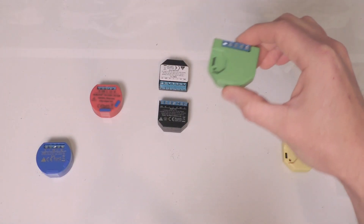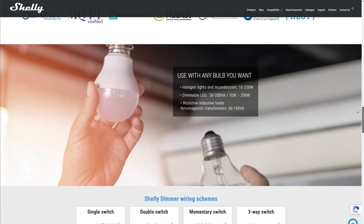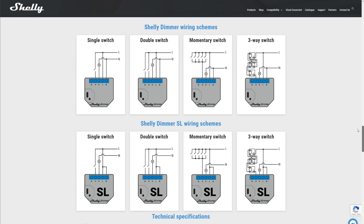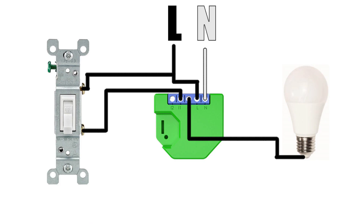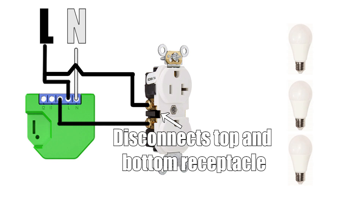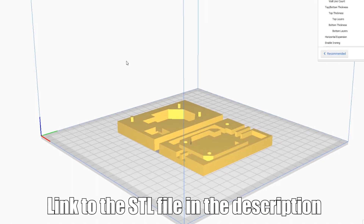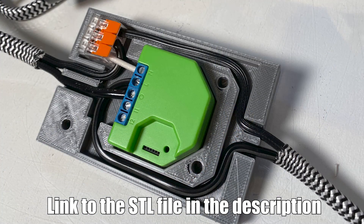The last and newest device in the Shelly lineup is the Shelly Dimmer, a triac-based dimmer that connects to mains power and can dim up to 200 watts of dimmable LEDs or halogen bulbs. The Shelly Dimmer comes in two types: standard and SL. The standard version requires a neutral connection like all other Shelly products, and the Shelly Dimmer SL is the first Shelly device that can be installed without a neutral connection — unfortunately only on 220 volts so far, so no luck for us Americans on 110 yet. The Shelly Dimmer can be installed behind a switch, but I think its best applications are less traditional. If you install it behind an unswitched receptacle, you can pop the hot wire tab and have a single dimmed outlet where you can plug in a power strip or extension cord to dim multiple lamps at once. So I whipped up a quick 3D-printed housing for the Shelly Dimmer and installed it inline on an extension cord.